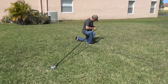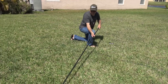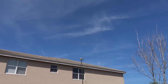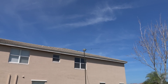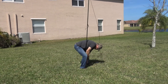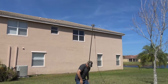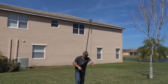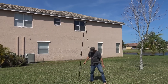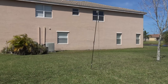John's hooking this up now. Basically we're taking the hybrid micro-balun off because you're not radiating through this extension — you're feeding it at the top. Now it's just a dipole, a horizontal dipole for VHF/UHF, using the stick as an extension. No counterpoise wire needed. There's the stake that he's having trouble pushing into the ground. There you go — this is right here for those who are also in an HOA. Let's say you wanted to get on a 2-meter net at night or there's a hurricane and you need 2 meters — a very portable setup.